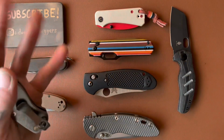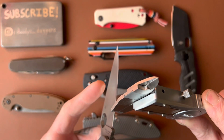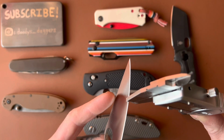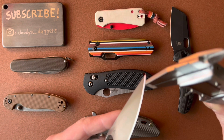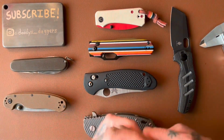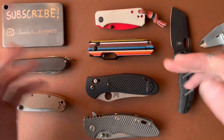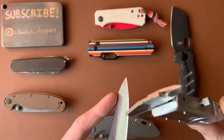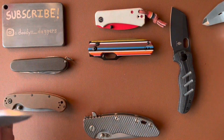Actually, let's do the PM2 as well. I believe it's a little thinner than the Griptilian. 26, 25, 25. So yeah, little thinner than the Griptilian. So 25/1000ths, you could say, we'll just say 26/1000ths is pretty thick. That's Griptilian. Let me check one more time. 27. We'll say 27/1000ths is thick.